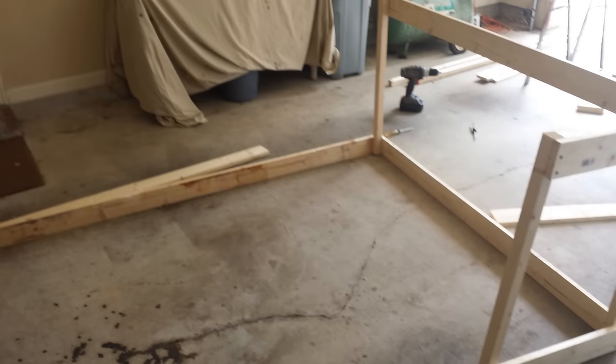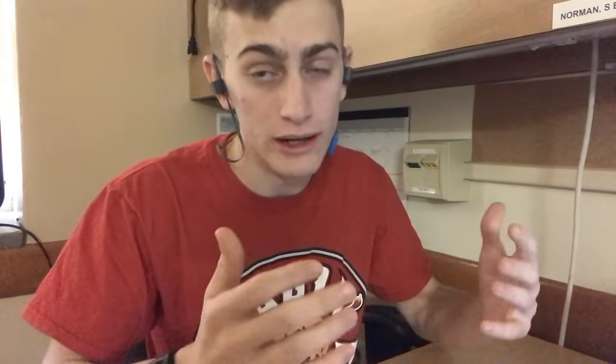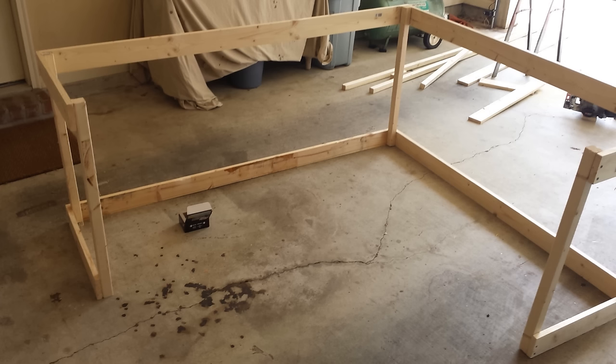You'll want to go off your 3D rendering to see what kind of frame you need. As you're building, you'll see you don't need a whole lot of engineering or math. You'll build the shape you want and notice where you need support. I used little 2x2 square plank pieces for corner pieces. You could also use metal brackets from Home Depot — probably less than a dollar a piece — to keep corners sturdy. The desk was so solid I could stand on it with all the components and it was perfectly sturdy.